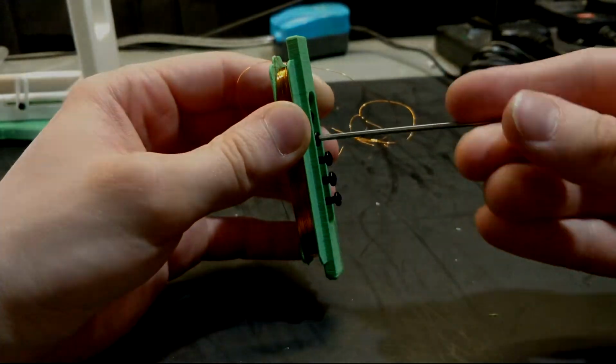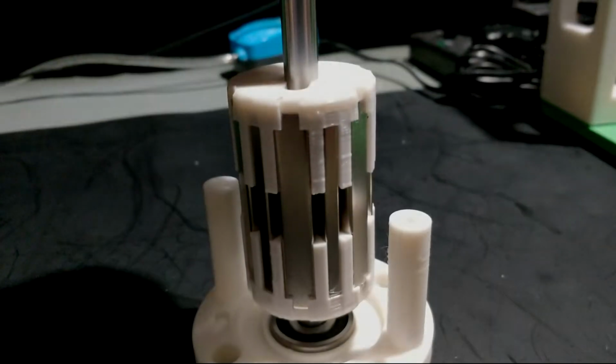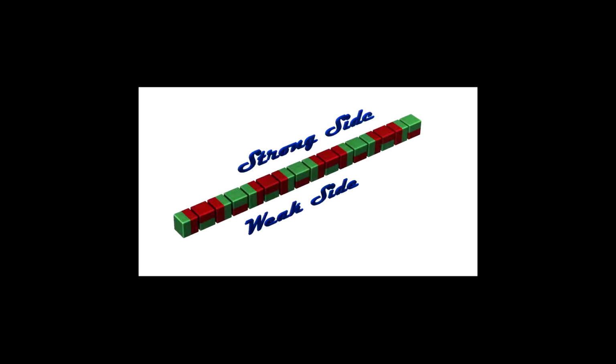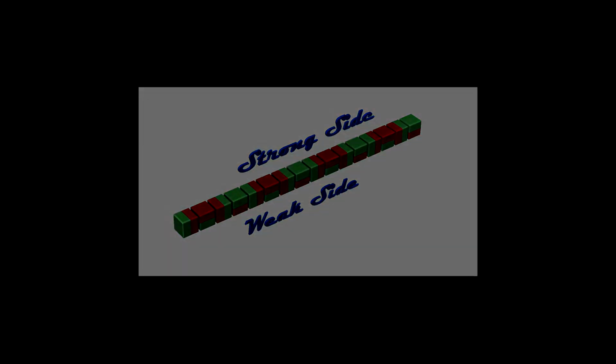The next thing we're going to do is build our rotor for our generator. As I showed in a previous video, I'm using a Halbach array for my generator. A Halbach array is a means of redirecting a magnetic field so that it is stronger where it is needed and weaker where it is not. This results in a stronger magnetic penetration at the cost of lower frequency. This is purely experimental, and I may try to make the generator again using a different kind of rotor.